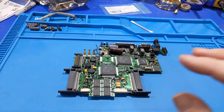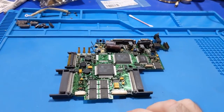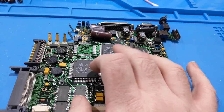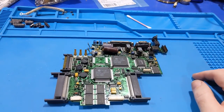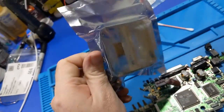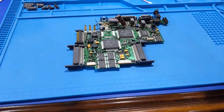I actually have the old CPU removed. I was unable to get any activity from the CPU whatsoever. I was probing it with my logic probe - got no activity on the data bus, the address bus, not even during a reset. The busy line was going high then low, but the reset line was not toggling. It goes directly into this VLSI, and I'm hoping this VLSI is not bad because I can't get either of these from the Chinese electronic parts houses. If that's bad, it's pretty much scrap at that point. On a hunch, I went ahead and ordered up a new old stock processor. We're going to install that and I hope that fixes it - all my voltages are there, everything's there.